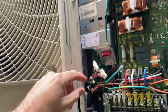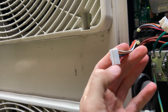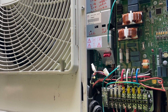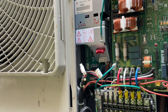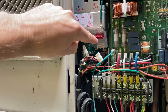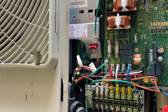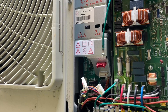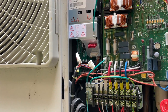I've now tested both fan motors and they don't check out. To do this, all you need to do is check the resistance and get that information from the Daikin app. Because they don't check out, I need to make sure it's not the board that's faulty. I'm going to check each prong on the board connector — three of the prongs should be 0 to 15 volts DC and one should be 250 to 350 volts DC. Just take your time and have all the information available.